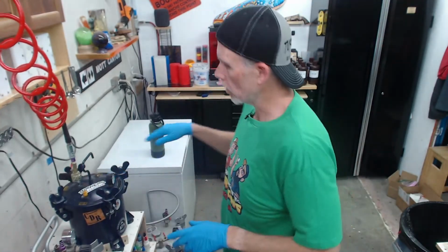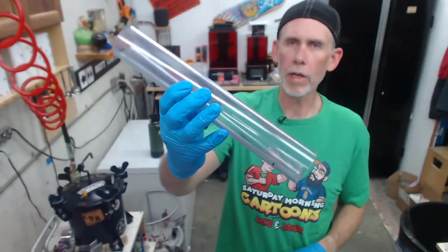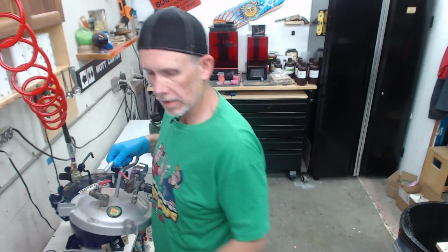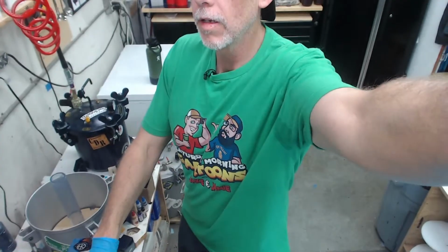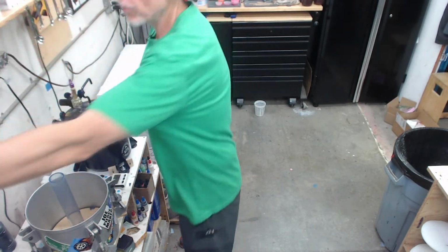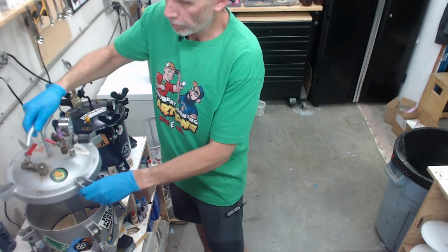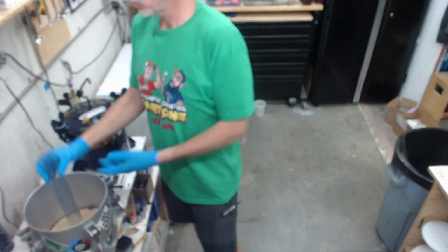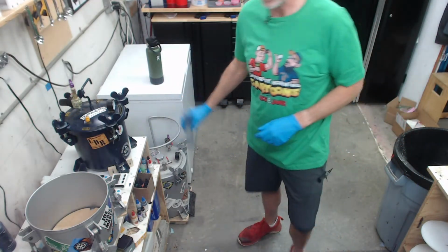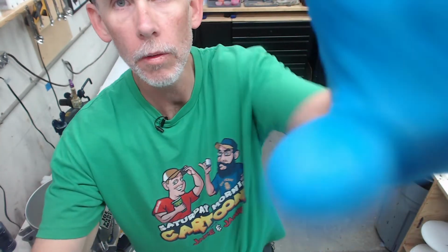And the other thing is, if you want to make a really big blank, make sure that you test your blank. Actually, you guys can't see that. Make sure you test that your mold fits in before you even start mixing resin up. If you're using a mold of some sort that you've never used before, make sure that it fits in your pressure pot, because you don't want to find that out with resin in it. So, if you're doing something larger like that, then you're going to want to get a 5-gallon pressure pot, so it can fit in there better. All right, let's see if there's any questions here.